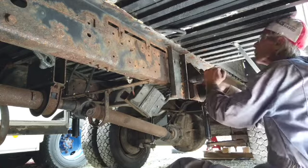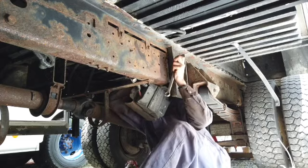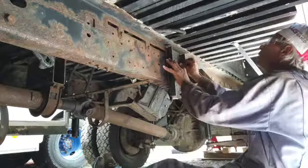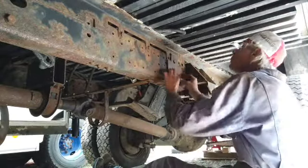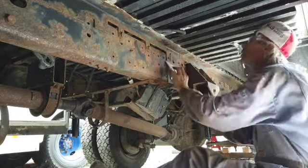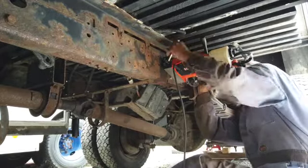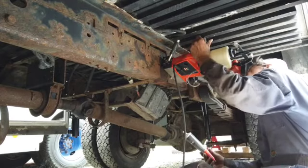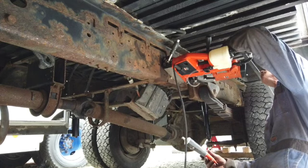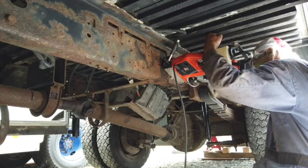If you want to get the drill bit really tight in your drill with these, what do they call them, tool-free chuck is the proper word. You're supposed to be able to put a drill bit in your drill and just tighten it by hand, but you never get it tight enough. So I use a hammer to tap it while I have my hand on the trigger, spinning the drill. Tap the chuck with the hammer, and it'll tighten that a lot more than you can by hand. Keep the drill from spinning.